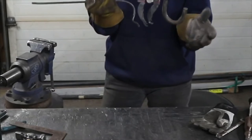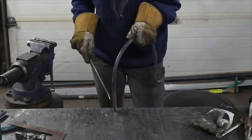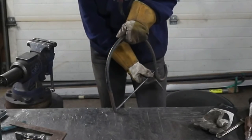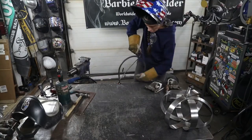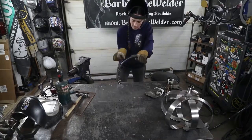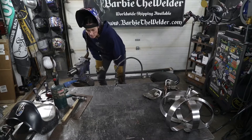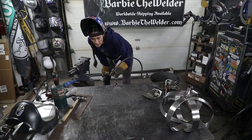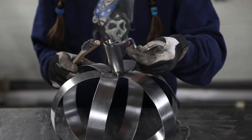I'm going to take an old plant hanger — five-eighths inch round — and weld it to my bench, also welding the bottom to hold it in place. Using a long piece, I'm going to start spinning the material around it until I can't spin it anymore. Once done by hand, I'll cut the bottom off each one — we'll have a little spiral piece to put on our pumpkin, and we can actually cut it in half to have two spirals. I've cut that spiral in half and tapered the end using my grinding disc.